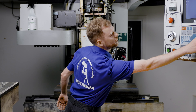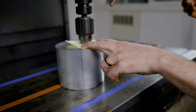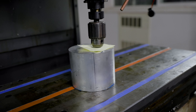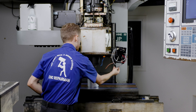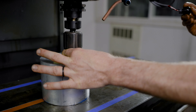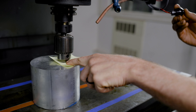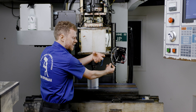Let's go to 110. Now I'm going to unclamp it again — tight, everything is locked up. That's within range. Let's go to 120. Now I hear a little bit of air coming out — that's coming out around the taper of the spindle — and I can move this tool and I can move the paper a little bit. I can feel it. Don't move it so much that the dogs get off. Go ahead and let it reclamp. So we are loose at 120.